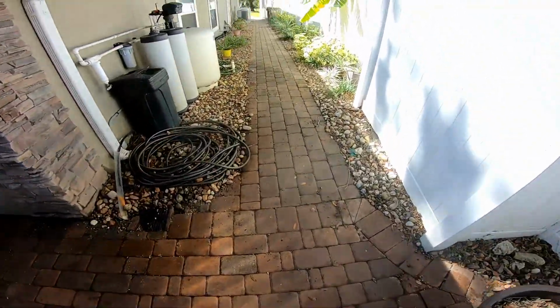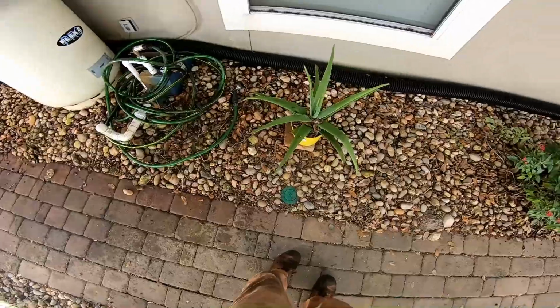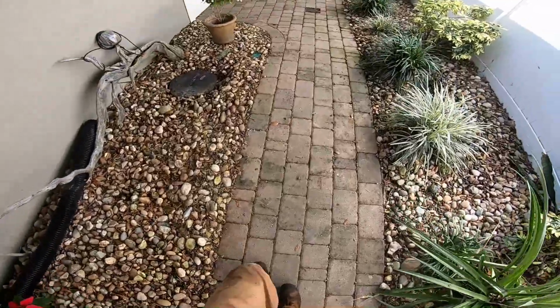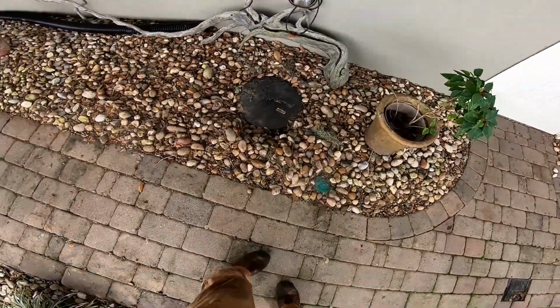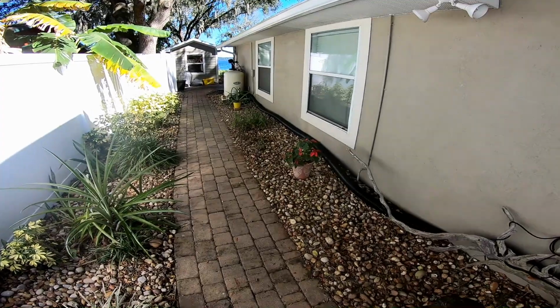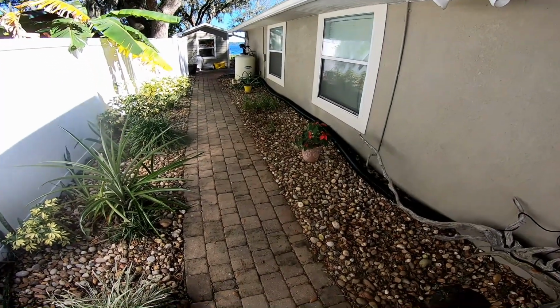And it runs all the way over here to the sump basin. We couldn't go through here because there's tanks down here. There's propane and oil, all kinds of stuff underground right there. So we had to do all of this in the pavers. And you can see our catch basin comes straight over to the sump pump. Sump pump lifts it up and sends it all the way back to that catch basin by the door. And then gravity takes over and sends it out.